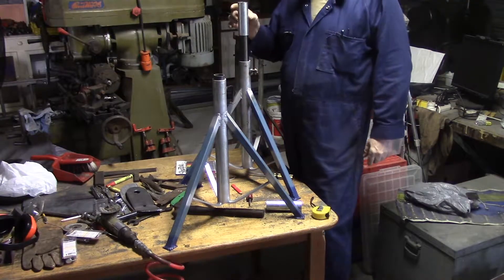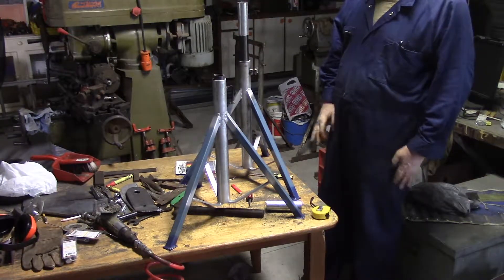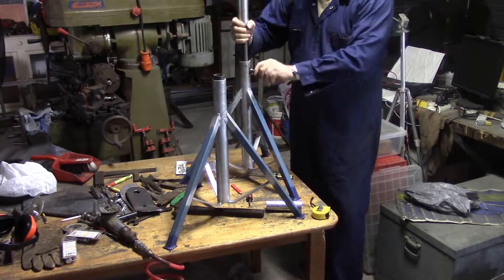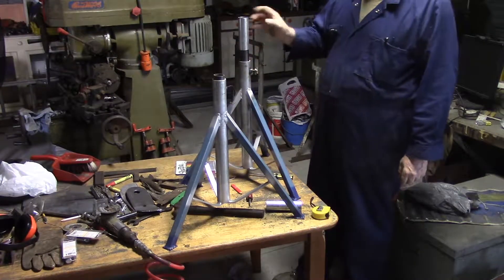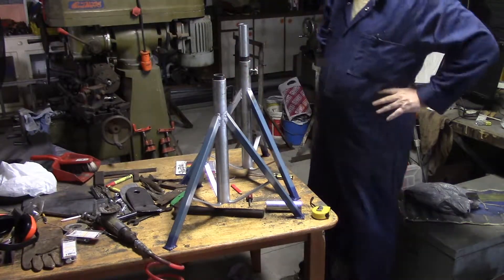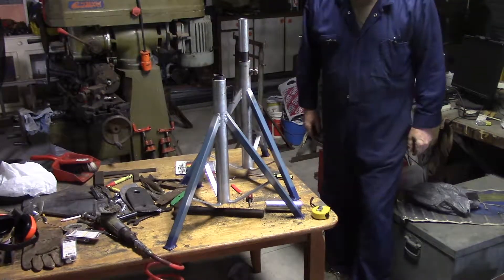However, I don't have a piece of pipe that's the same size as this one. I was going to put a little stem of solid on it just to sit down in there — inch and a half into there just to hold it. I don't have that, but I do have this bit of pipe, and there's a nice neat fit over it. So what I'm going to do is make this whole section removable, which it already is. I'll weld this piece onto the pipe and weld the heads onto these. That means if I want to change it at any time I've just got to make the whole piece rather than just the head. Given what I built them for, I don't think that's very likely. You can build it to the plan and just change the head off, or do as I'm doing and weld the whole thing to the center section if you don't think you'll ever need to change the head.